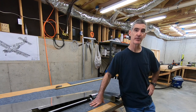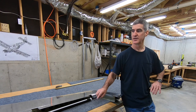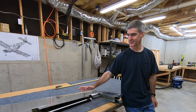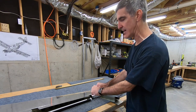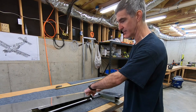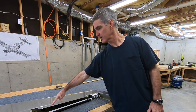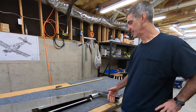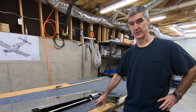In a couple of minutes my wife's going to come down and help me. I'll have her twist on the end of the pipe and I'll sort of help it along and form it. You need to hold down on it, kind of down and out and roll it. You don't want to put the bend back here against the spar. The idea is to try to roll the skin in, so it's definitely a two-person job.